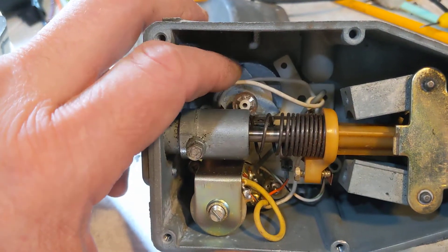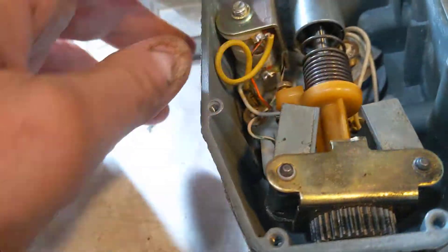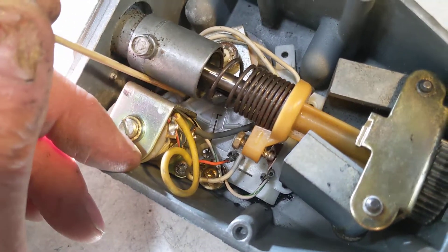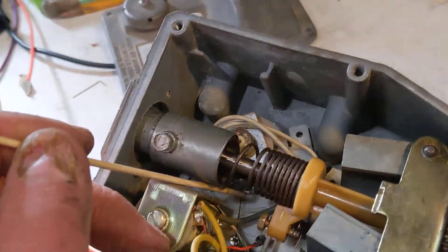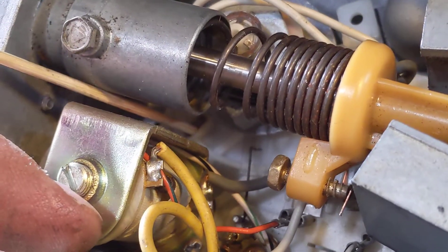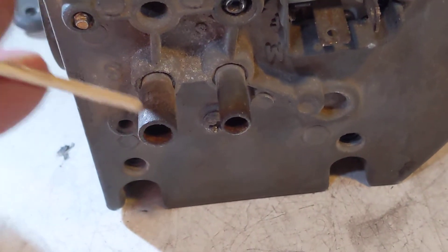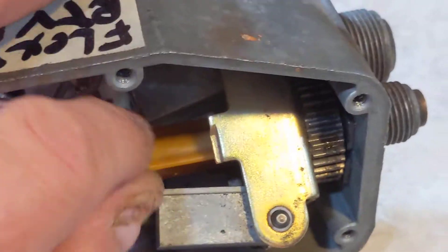What this does is a magnetic clutch — it pulls this piece of metal down and it touches this wheel. The wheel moves; it's really difficult to see. Down in here is a little piece of plastic that opens and closes a slot. When this solenoid opens, it allows vacuum to be released to atmosphere before it gets to the output. The trick here is that speed is proportional to the amount this moves open.